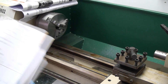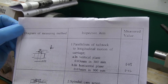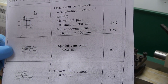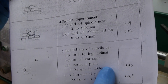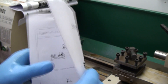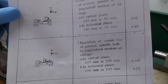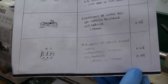The inspection record basically tells you what tolerances were measured on your machine at the factory. The numbers don't look impressive — ten thousandths, ten, twenty. Not great, but hopefully with some upgrades and some good adjustment these tolerances can be tightened up a little bit. I'm brand new to machining, so really anything within a few thousandths is probably going to feel pretty good, because I'm used to eyeballing it with a ruler.